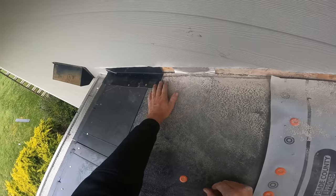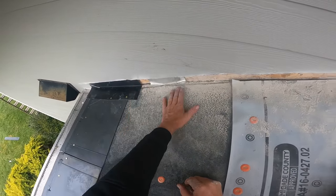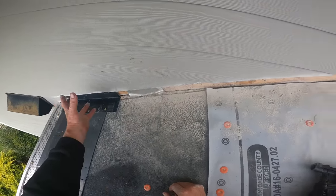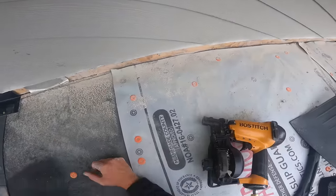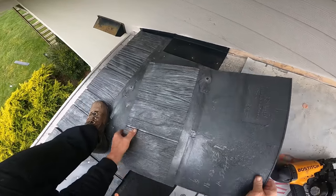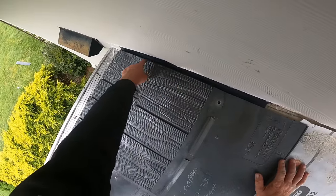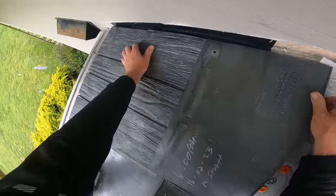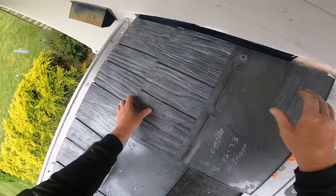The way we cut this back a couple inches extra is really important — even this fiber cement stuff is not supposed to touch the roof surface because it will moisture in and completely delaminate and fall apart. Keeping it up at least an inch is what I'd recommend. Here's our second piece of step flashing, and you can see the next row is going to interlock over that — water can't get in on the edge or into the wall. It wasn't anything here to start with, believe it or not. We're trying to make it right.